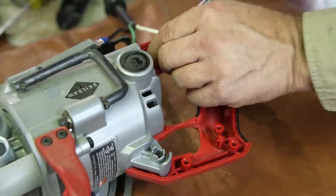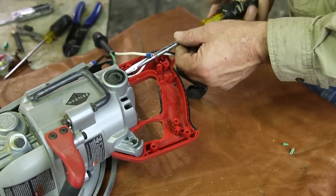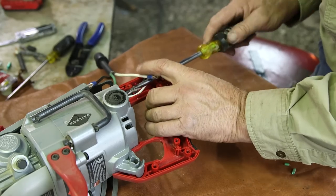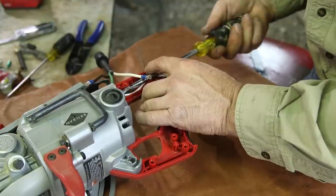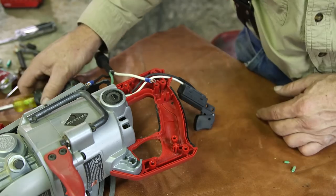When you're manipulating these screws, you have to pay attention and never forget that in the 21st century, it's considered standard practice sometimes to thread screws into plastic or fiberglass or whatever the material is on the other side, so they're easy to strip. So in general, you take them up to where they're just good and snug. But once they're snug, you back off of it.